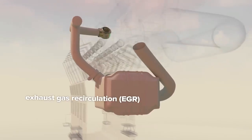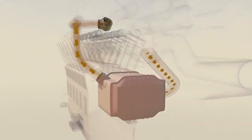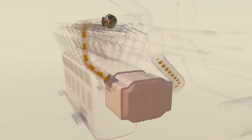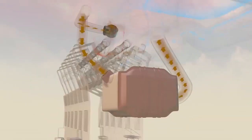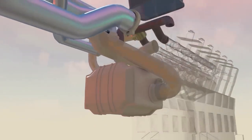To dramatically reduce certain pollutants and exhaust gases, these diesel engines are equipped with an EGR, or Exhaust Gas Recirculation System. A valve allows exhaust from the left cylinder bank to enter the EGR system, where it passes through a water cooling unit before being mixed with fresh incoming air. Sending some exhaust gas back through the combustion process lowers combustion efficiency in favor of greatly reducing exhaust pollutants overall.